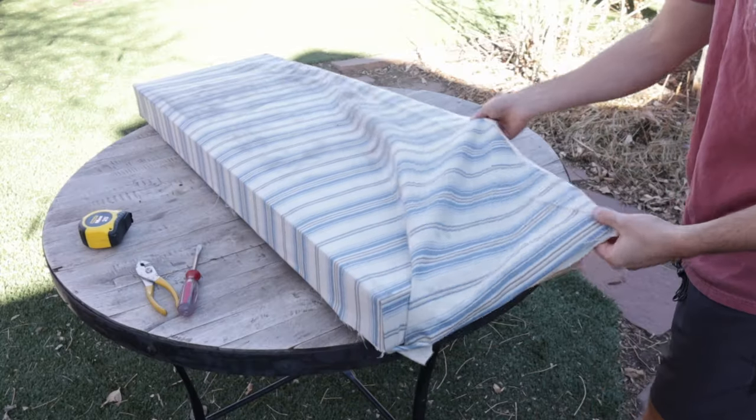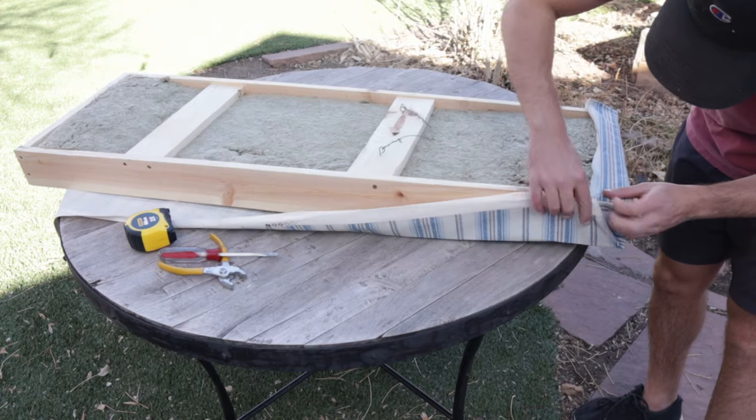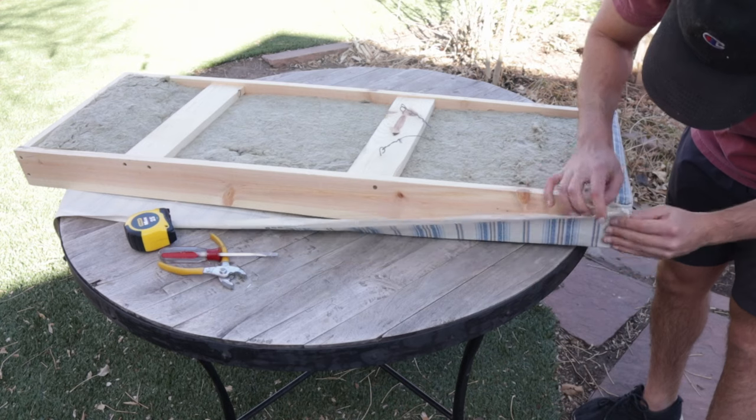After the insulation is in place, you're going to want to wrap that fabric around the insulation to hold it in place. Wrap it with your chosen fabric — this is why I would choose that black duck canvas, because I think black is one of the cleanest looks you can have. But if you want to use tan or a pattern fabric, that's also fine. This is going to make it look less like a DIY disaster and more like a piece of art. Stretch it, staple it, and admire it. Fold over the excess corners of the fabric to make sure everything looks nice, and keep the fabric taut as you staple it to keep wrinkles away from the main panel face.